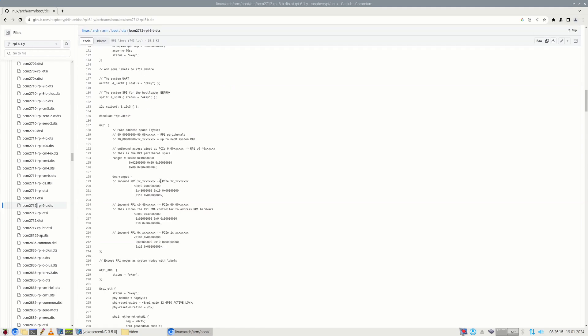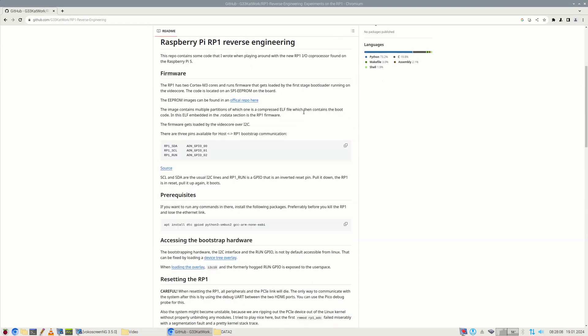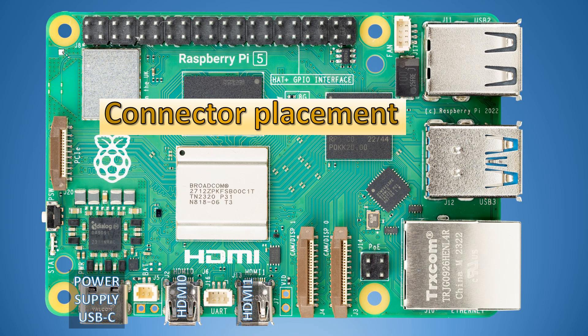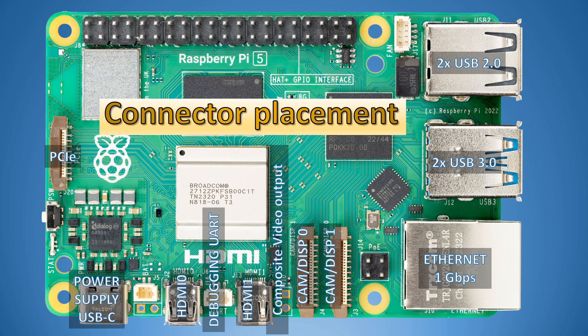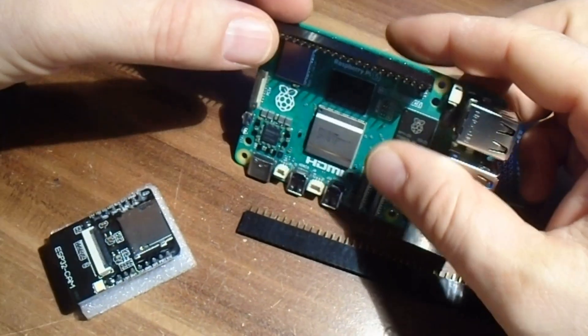There is also another project that tackles the primary bootloader — it targets the RP-1 I/O controller and tries to rewrite code for it. It is a very interesting project, though unfortunately it has not been finished yet and is still a work in progress. The RP-1 microcontroller is in many ways similar to the popular ESP32 microcontroller used in various Arduino projects. If you have a system on chip that can communicate with a microcontroller you can fully control, you can make very interesting hardware projects. I hope Raspberry Pi will decide to open up and develop software tools to program the RP-1 microcontroller and let us change its functionalities, as it would open a wide field for hardware developers.